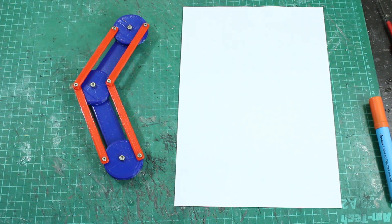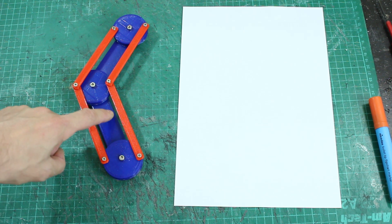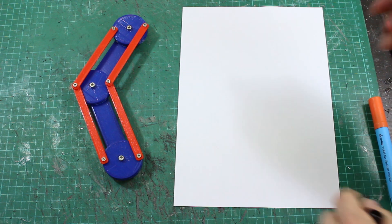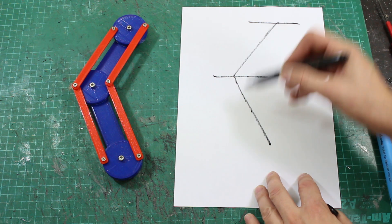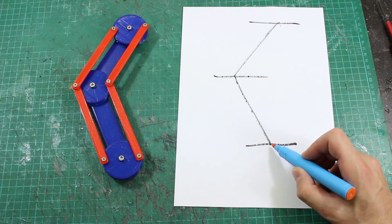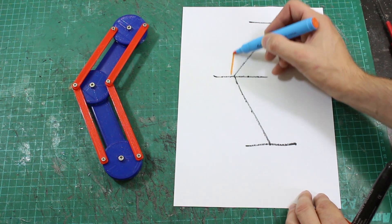When we move the foot up or left or right, we need to allow it to move in straight lines, and that means syncing the two motors together. The proper way to do that is to work out the kinematic model — specifically the forward and inverse kinematics. Forward kinematics means taking the joint angles and working out where the end point is. If we imagine this on an XY grid, we take into account the two angles for the top and the bottom and calculate where the end point is knowing those angles from the hip.